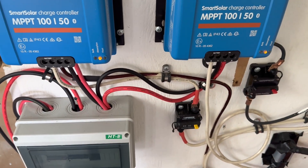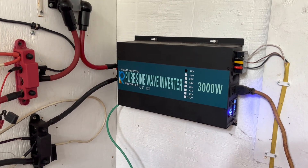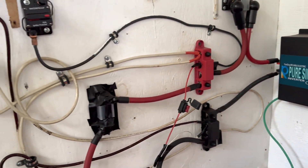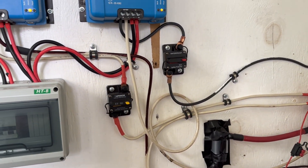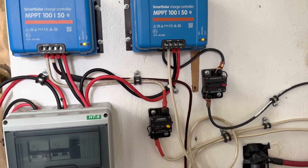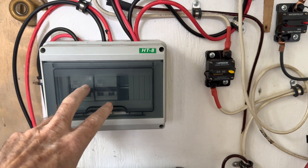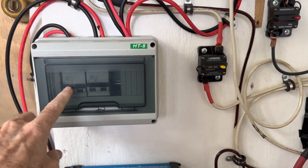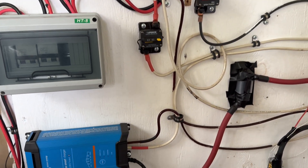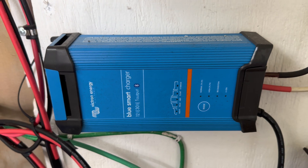I added a Reliable 3000 watt pure sine wave inverter — you can see I've got it tied into a couple of bus bars, along with a couple of DC breakers from the charge controllers between the charge controller and the bus bars. I also added a solar isolator switch so I can quickly open it and cut off my solar panels anytime I make further adjustments.